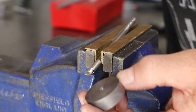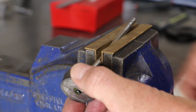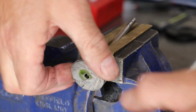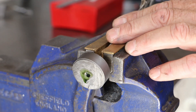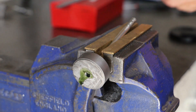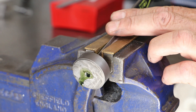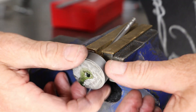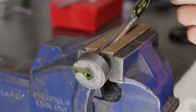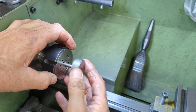Although the rod is a very tight fit in the piston, I also use some Loctite 648 — I really don't want this moving. Loctite 648 is good up to 175 degrees centigrade, which may be borderline for steam at 80 psi, but I think I'll be okay. I'm measuring the stick-out on the rod because I've made it to final length and need to ensure it's positioned correctly with respect to the piston — ultimately looking for 180 millimeters from the top of the piston to the end of the rod. As I haven't yet faced off the piston, I have to measure against the face that is available.